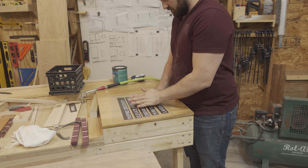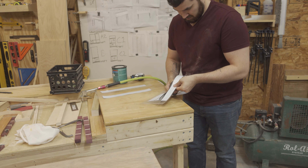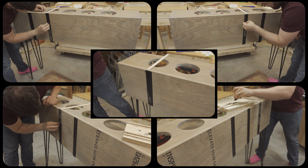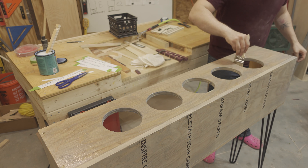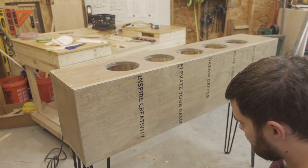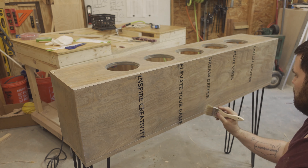And now, easily the most difficult and stressful part of this entire build: the lettering. Redi wanted to have verbiage applied beneath each of the 24-inch tubes, so using my vinyl cutter, I created some stencils using non-permanent vinyl, being careful to apply the stencil in line with center on each hole, and then lightly applied black paint. This was stressful not because it required advanced skill, but because any mistake would require re-sanding and finishing potentially the entire front of the piece — adding hours or days to the project when accounting for drying time. Luckily, everything applied cleanly with no bleeding.